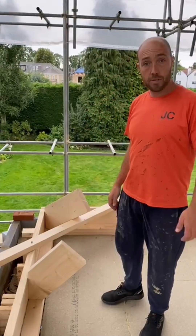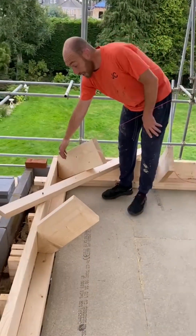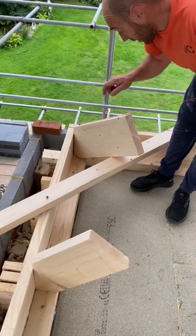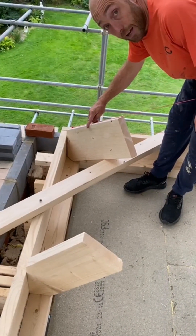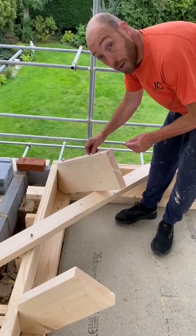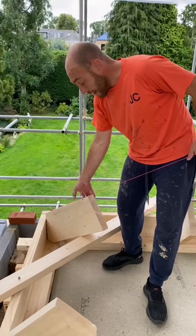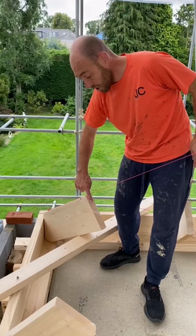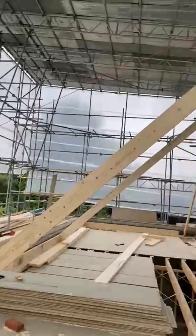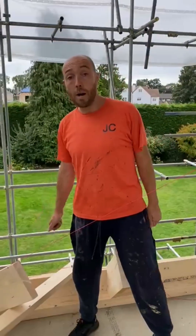Good work tips on hips — box gutter, or any sort of hips really — but illustrated here where we've got a box gutter and a hard base going round. Make some dummy little rafters and then put your lines through to make sure your edge is right. If you cut the bottoms of your hips and the tops of your hips, fix them, pin a line through, and instead of trying to measure them in one big long one, once you've got all the angles right and they're straight and in line, you can just measure from the offcut of the bottom and the top, and it makes it very easy to do so.